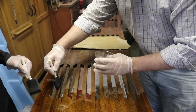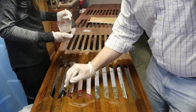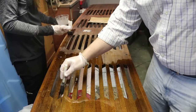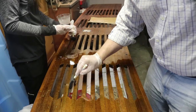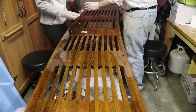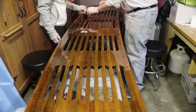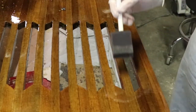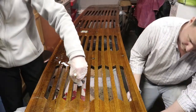We're starting to spread varnish all along the platform, and we want to make sure that we're getting in between the grooves here. Nikki and I are taking it slow — long, even strokes. We want to make sure that the coat is even and uniform all the way down the whole length, and that the platform is completely covered. There are going to be little air bubbles that pop up, so you want someone to go back through where you already spread the varnish and tip those off.